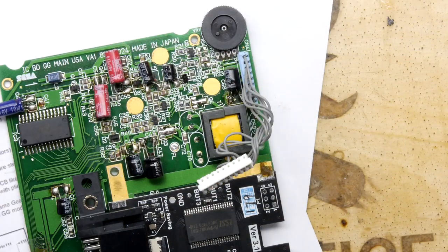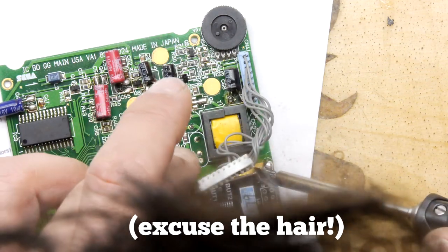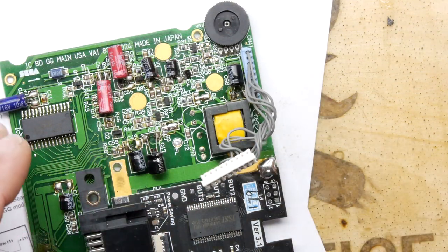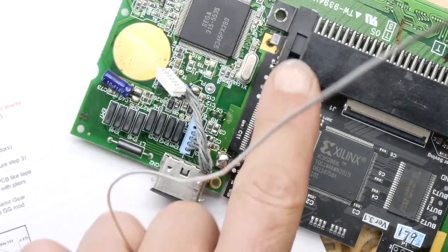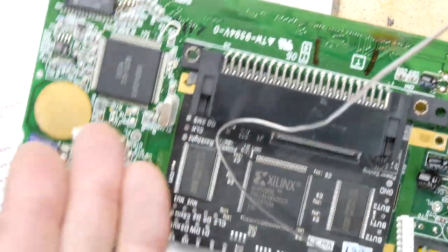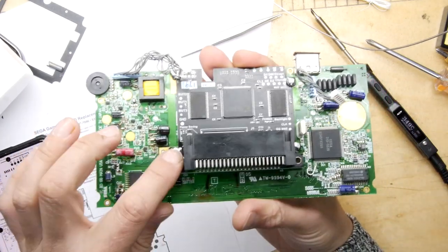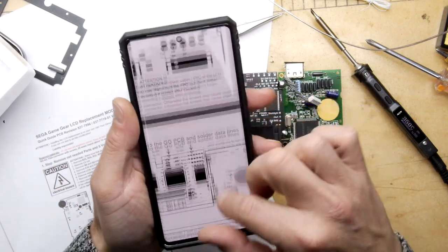I'm a little concerned that we do appear to be totally blocking screw holes, which could be an issue in the future, but we'll just continue and worry about it if we have to. That is a lovely solder blob - it's not going anywhere. I might even touch up this one to match. These holes are actually for affixing the reflector but they probably add some support to this PCB too. Now that I'm done, it's quite heavy duty - you've obviously added a big chunk of PCB with four considerable solder anchors.